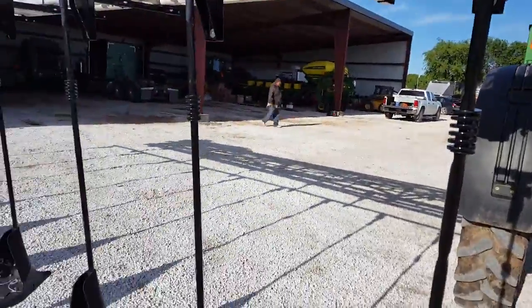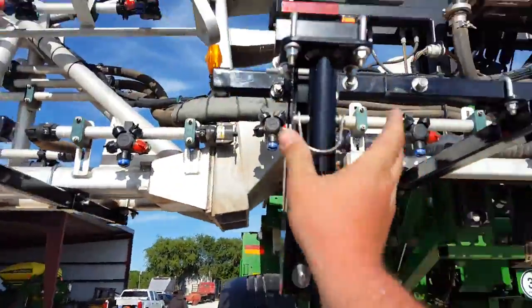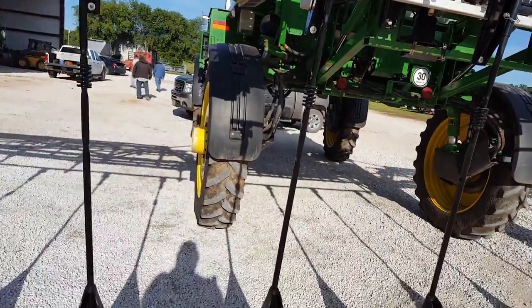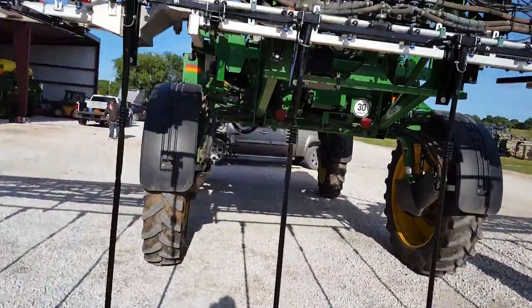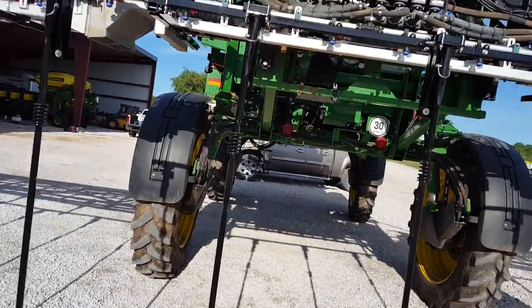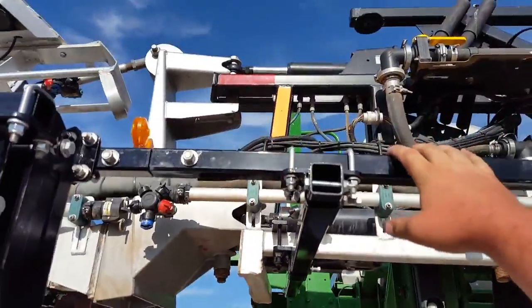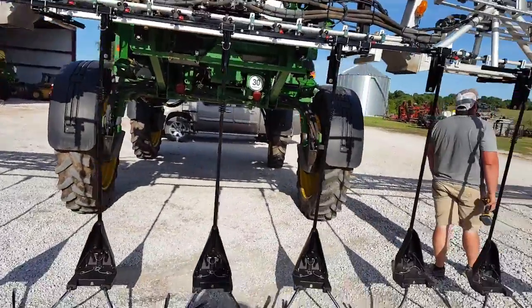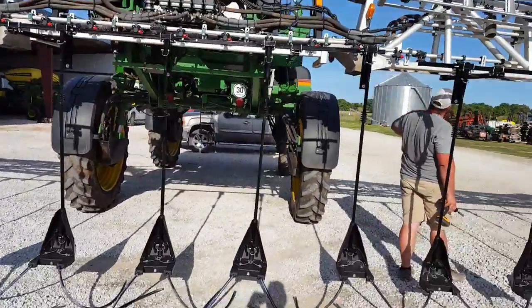But it's very simple. But what I would make sure you do is lay everything out. Get the bases and the risers and the breakaways, and take all those boxes and pull them away from it, because if you sit there and look at it, it's gonna bother you because you don't know where anything goes. It's very straightforward. Once you lay these out perpendicular and you lay these out parallel, it starts to really make sense. Put your brackets on them, and it should really start to fall into place. And once you do one, you can do 100.